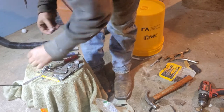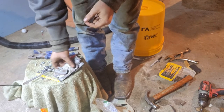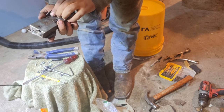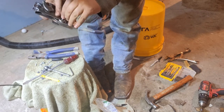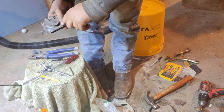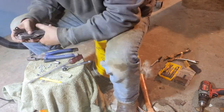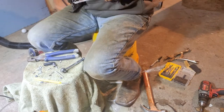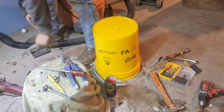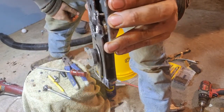I've got my machine screw — this is a 10-32 machine screw, and this is a 10-32 nut. This isn't the one I bought; this is the one I improvised because I had to weld the one I bought to the stud that was stuck earlier. This slots into there — this is your keeper, this is what keeps it from overextending. I'm going to crank this guy down. You don't want to make it too tight — just tighten it up, you don't want it to stick. That last step was to grind it flush so it'll sit inside the door jamb without interfering with anything.